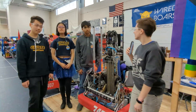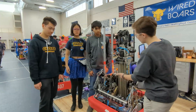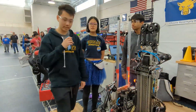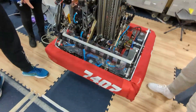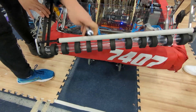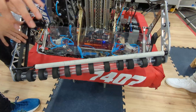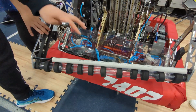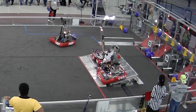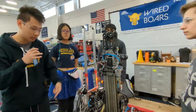I'm here with William, Sherry, and Sid to take us through a few of their different mechanisms. Can you start with the intake and forks mechanisms? Those are some of my favorite things I've seen out on the field today. So this is our cube intake — it allows us to intake cubes from the ground using these rollers. It intakes into this area where we can hold a cube and score low, which allows us to do floor cube low scoring really, really quick. But if we want to score in a higher node, we can pick it up into our claw with a handoff and then score into higher nodes.